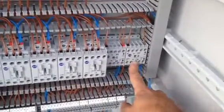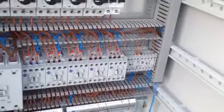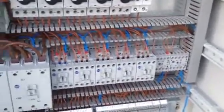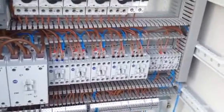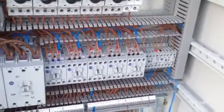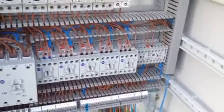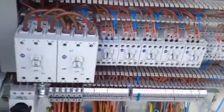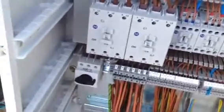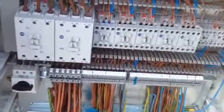This is your water mixer. Over here you've got your cooling solenoid and your water solenoid. The water solenoid is the one where I have a two-inch pipe coming into the tank. When the tank is empty, the electrode senses that and turns the system off and turns the water solenoid on so it fills the tank. And this is your on/off switch.